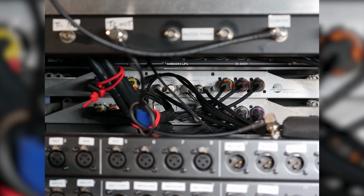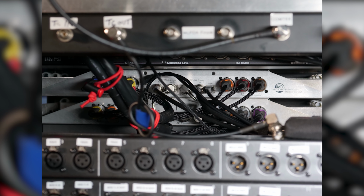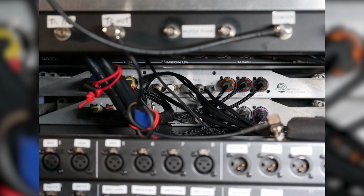So what we ended up doing is we had your venue receivers. We had 2 6-channel receivers. For those, we used 8-channel snake cables, cut off 2 of the channels, and ended up with 6-channel snake looms for each of those. And what kind of cable was this? This was Mogami 8-channel, 2-core shielded cable. We were able to get that cable, find the length that it needs to be, and fan it out, and even get the fan outs to the right length so that they fall into the venue systems, just getting the right lengths on all of the fans.